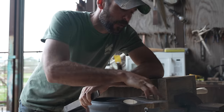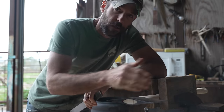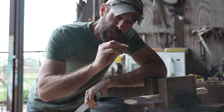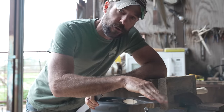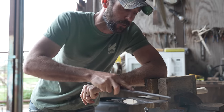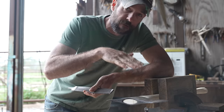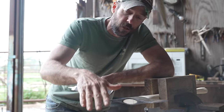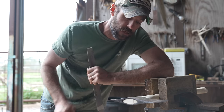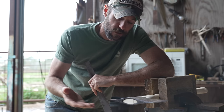What I'm feeling for here is on the opposite side that you're filing, you should eventually get a burr — that's that very thin edge on your blade that's starting to curl away from whatever you're sharpening with. Typically when you file from the blade out, you'll create a bigger burr than if you file from the outside towards the inside of the blade. That's not necessarily a good or a bad thing, it's just something to know.